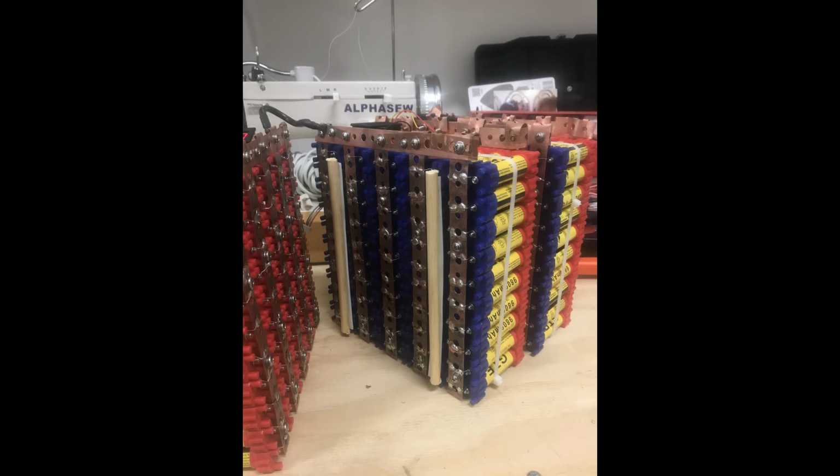After completing all the wiring for the battery pack, now it's time to secure it all together. So the first thing I did was I took 1/4 inch wood dowels, cut them to the height of the battery pack, and placed 2 of them in between each one of the cells. This then allowed me to tighten the pack up using 4 48 inch zip ties.